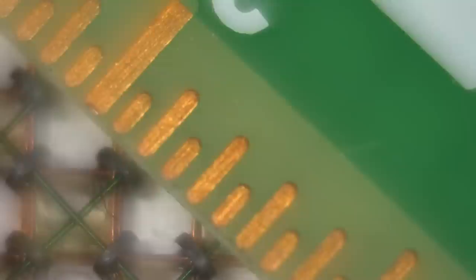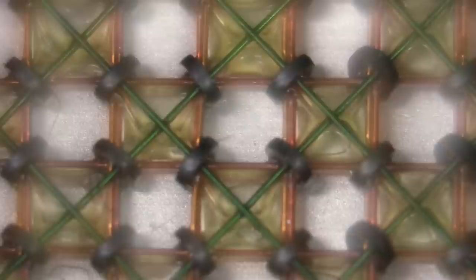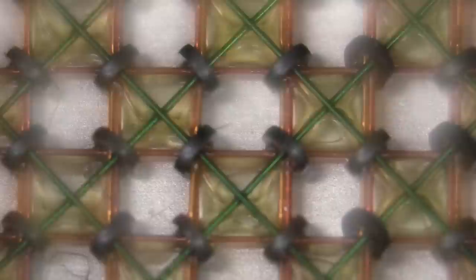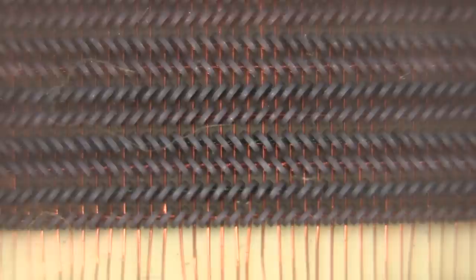That's just crazy. So there's an attempt to measure it with my micro ruler there, and well, each little ferrite ring's about roughly just under half a millimeter diameter. Actually, they're not a huge amount smaller than the existing ferrite rings that I had on the previous one I showed. It's really essentially just the density that they're able to thread these things with. I mean, it's got to be, I don't know, at least 10 times the density in this thing compared to the old board. Just look at that. There's no comparison in the density of that. So let's call it almost the same size ferrite ring, slightly smaller, but that density, they overlap each other in the horizontal direction there.